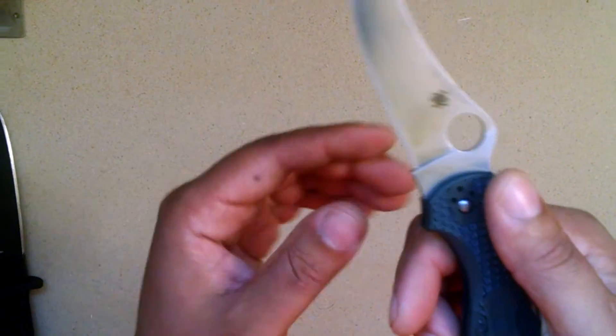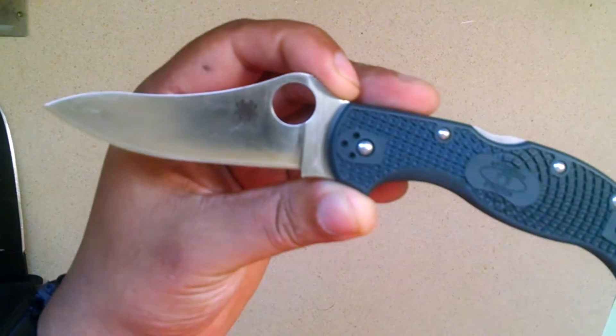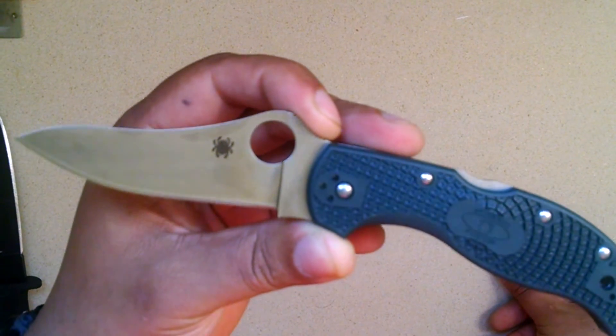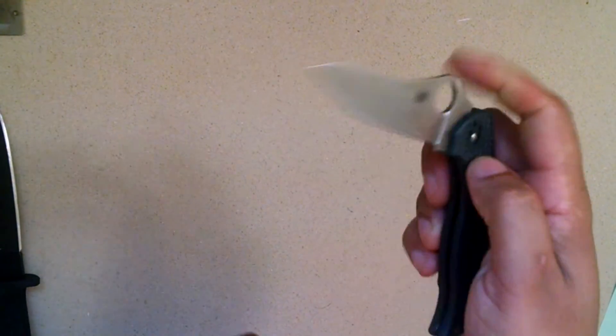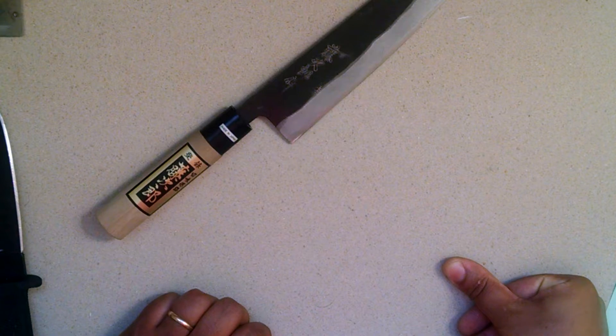So you don't really have a terrible amount of free chromium to resist the rust. I've got a little bit of rusting there — I live in a pretty humid environment. You don't quite have enough freed up to resist the rust formation. Interesting. So what is the highest carbon steel out there? Well this isn't quite it — this is white number two, Shirogami two.